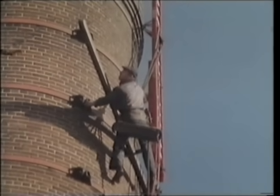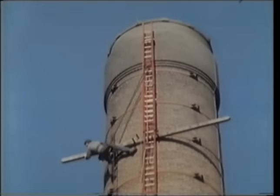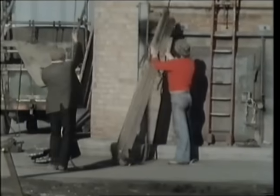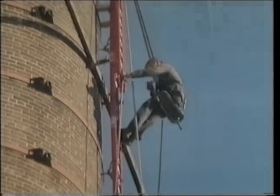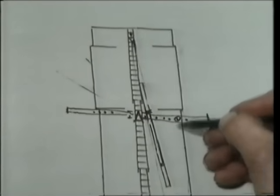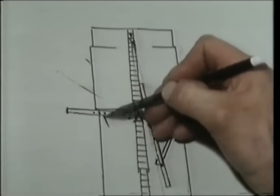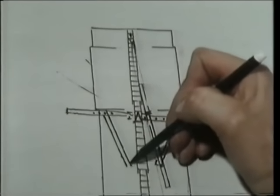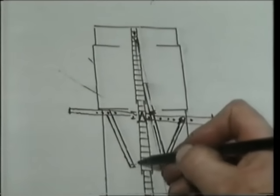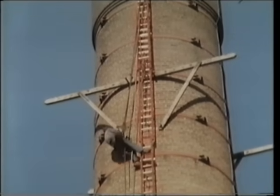When I get on my seat board, I give it a little bounce and just see whether it's safe or not, and it's never broke yet, but I'm always ready to grab that bloody ladder if it does break. This baton has a series of holes drilled in it, and I proceed to bolt one on there and one over there. Then I'll lower myself down on my bosun's chair, mark the suitable joint at the bottom, and knock a pin through there and a pin through there — so I've then got it all braced up quite solid.